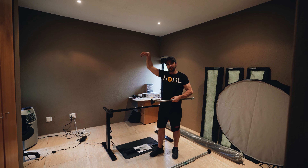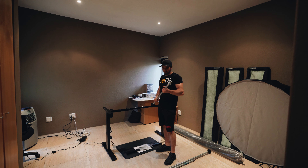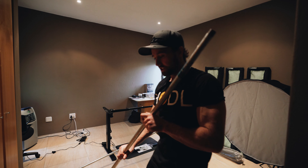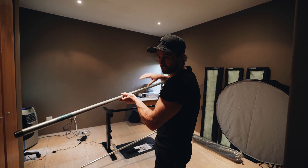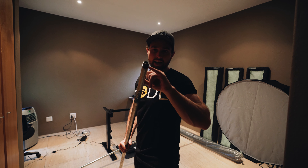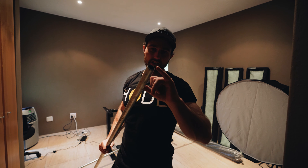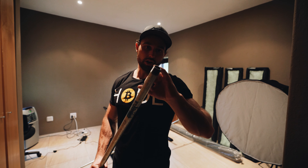It's also going to be really cool for an overhead camera rig if I want to do something actually on the desk. If you want to do something similar, just find a good piece of galvanized steel pipe. If you get a piece of galvanized steel pole and have it cut for you, remember you're going to get one probably long piece of pole. When you go to the hardware store, ask them to cut your lengths from the end of the pole — the reason why is you're going to retain the thread, which you might need. For example in the T-junction we're using, we need the thread.